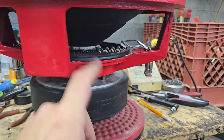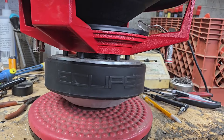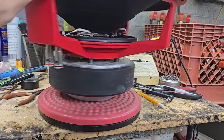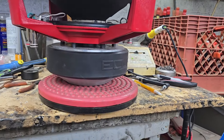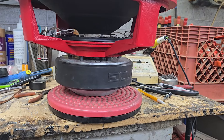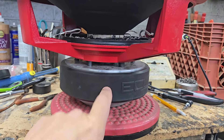We did our spider — eight inch spider clamp — did spacers underneath. These are the copper coils — the Mexican ones, from my buddy in Mexico. Copper, very nice. 50 millimeter wind height, so it's about the max you want to do on either the TC9 or TC9 plus. You don't really want to go more than that.